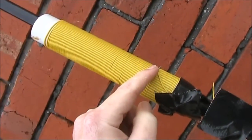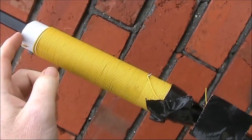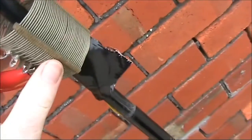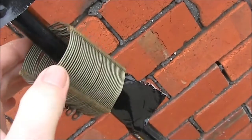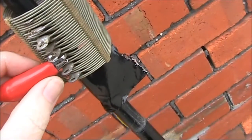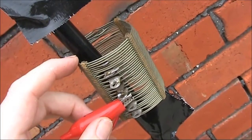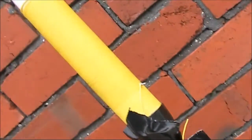As to the coil details, it's about 96 turns of thin insulated wire. The outside diameter of the former is around 35 millimetres. And as to this coil, that's a somewhat thicker coil, around 45 or 50 millimetres, and it's tapped about halfway. You really need to do your own experiments and testing as to the number of turns you'll need for the frequencies you want.